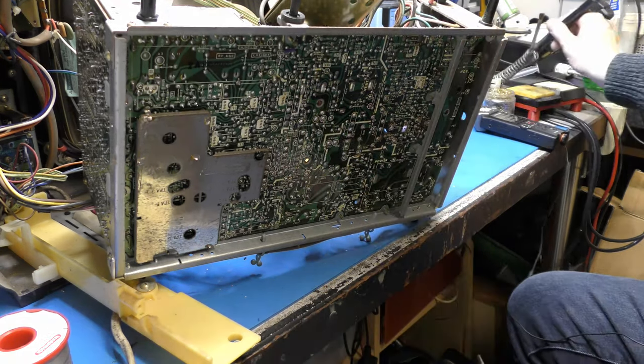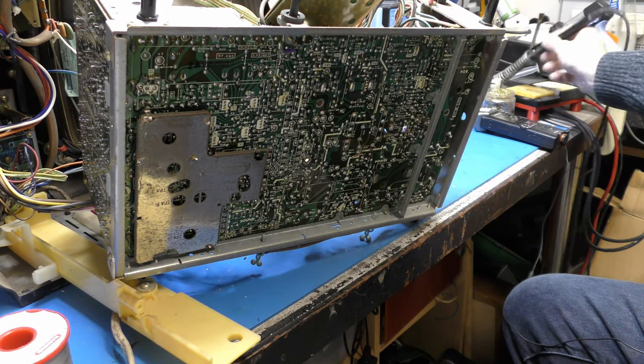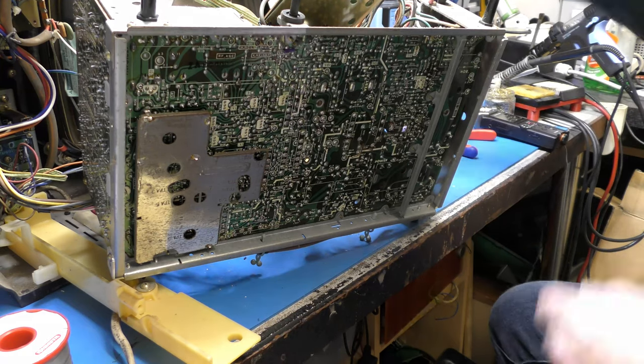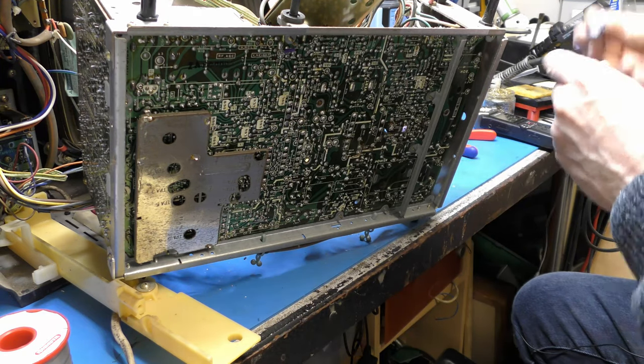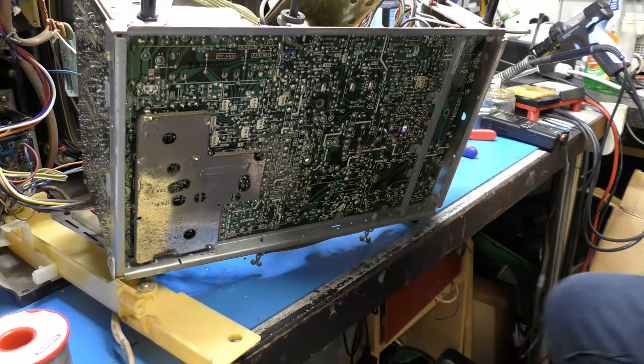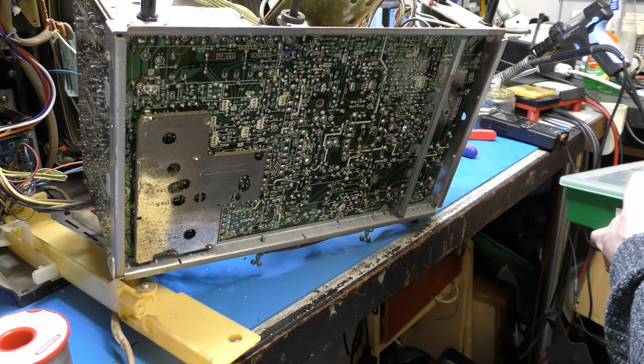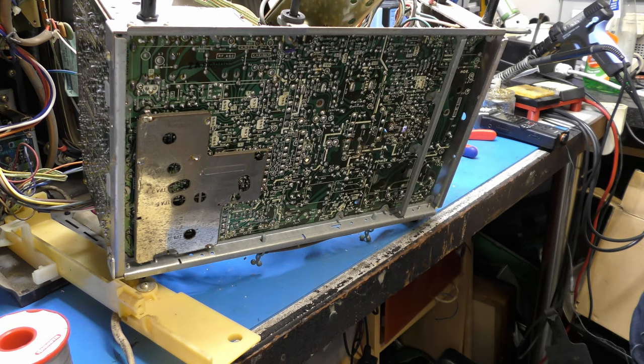And that is, I think, it's coming straight off the switch mode transformer, straight via a diode. I think that's our main HT smoothing capacitor. Yeah, 10 mic at 250 volts, so yeah, chances are good, aren't they? 10 mic at 250. Not in that box we won't have.